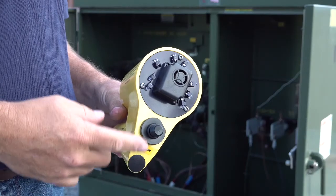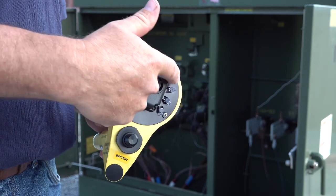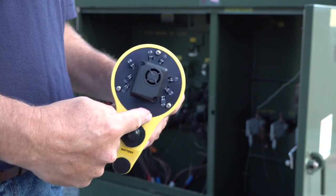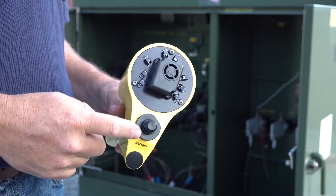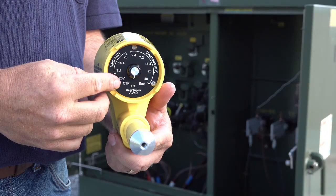The face of the AV40 consists of an outdoor-rated 100 dB alarm, a 360-degree array of super-bright red LEDs that can be seen from any angle, and a live-line tool fitting to connect an adapter for the preferred hot stick attachment. The back of the AV40 consists of a 12-position selector switch. Each switch position has been specifically adjusted to detect a potential either in an underground or URD scenario or in an overhead scenario.